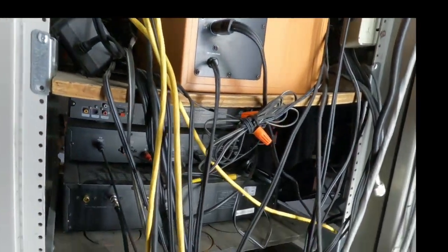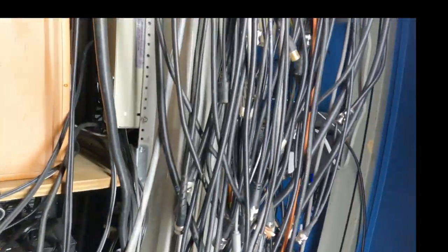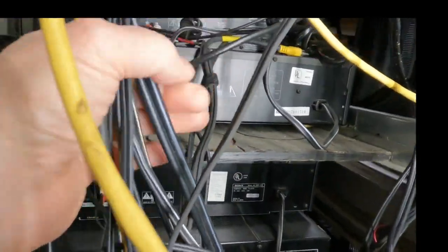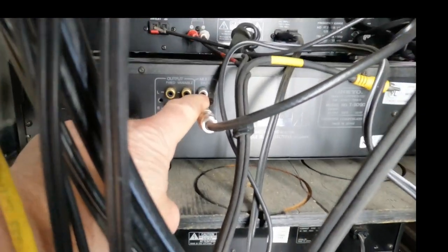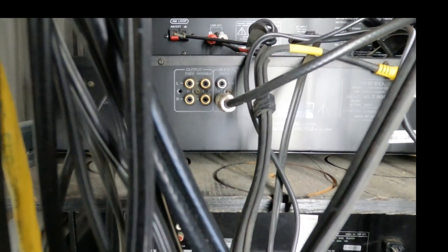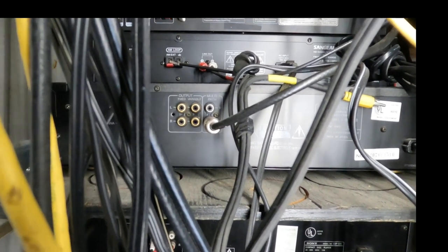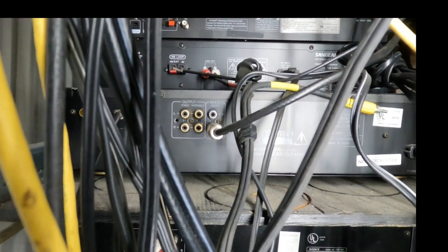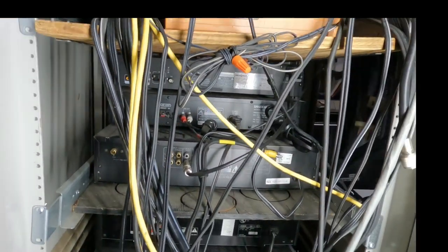So here's the, this has got to look really good. These are test cables here, but here's the receiver. And you can see in the back there that there is something called multipath. Can you see it? Anyway, it's called multipath, and you take both of those, connect them to the vertical and horizontal inputs of an oscilloscope, and you would get a diagonal line using the XY inputs, and then you would be able to tune your antenna system for maximum clarity or minimum multipath.